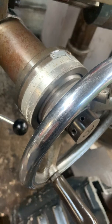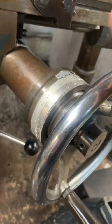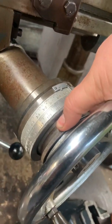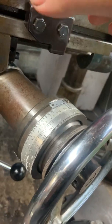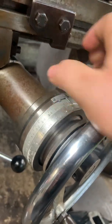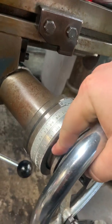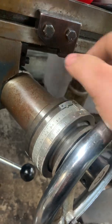I engaged the roll pin on the bush that sits on the spindle that's keyed, and we now have it holding its zero. How this basically works — it isn't a screw-up type; you pull this collar back, there are two circular racks, and that is what allows you to set your zero. You cannot turn it until you pull this back — it's a two-handed job — and you can thumb this wheel round to your zero.